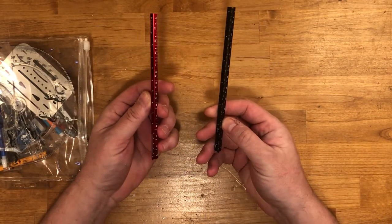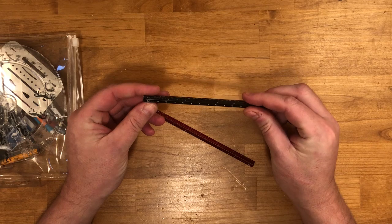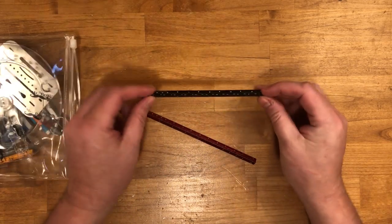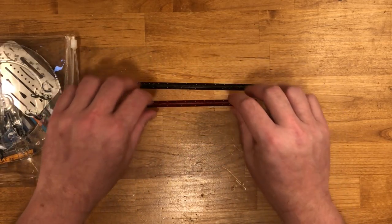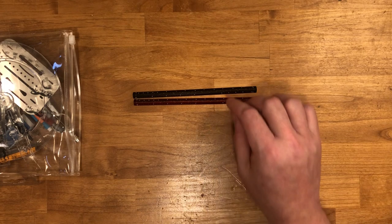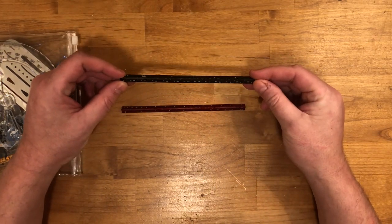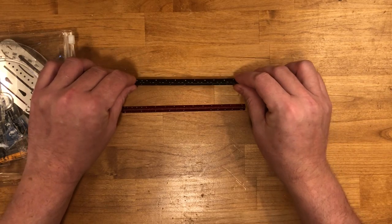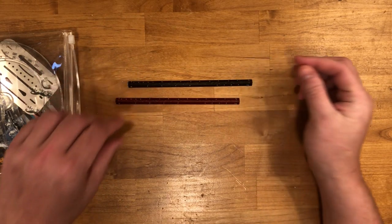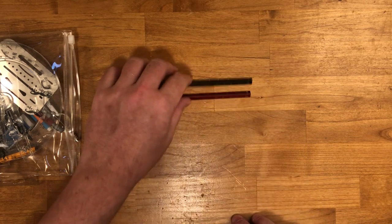The next thing I wanted to talk about are these two rulers. These are called architect scales. They have multiple sides on them because you can measure in different scales — full-sized, one and a half inch, three-eighths inch, and so forth. There were supposed to be two different scales in here, but I think the folks that sold us these made a mistake. That's okay. The other ruler is an engineer's scale. The engineer scale is also three-sided and works in hundreds and tenths. For our purposes, this is the imperial architect scale. It works in half inch, eighth inch, sixteenth, quarter, and so forth — we'll go over this in the future. You have two that are identical.